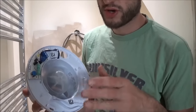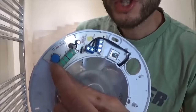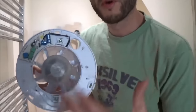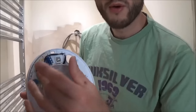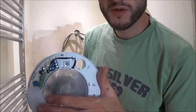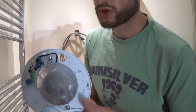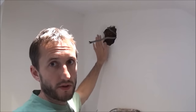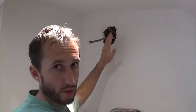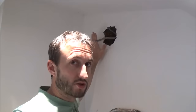You can get humidity settings, timer run-on settings, and some fans have high and low speed settings — check your instructions for your model. This one is just a timer: there's a little blue circle you can turn left or right to adjust the timer overrun — so when you turn the light switch off, the fan keeps running for the set time. The maximum on this is 30 minutes. It's best to leave it at the maximum to clear moisture after a shower. This 110mm hole was cut with a diamond core drill bit.